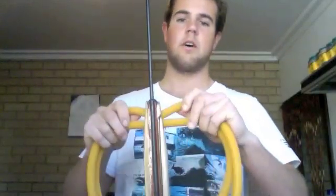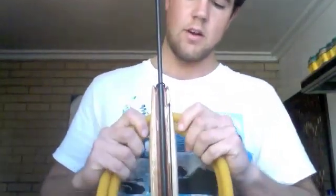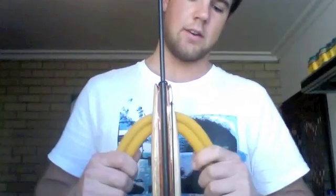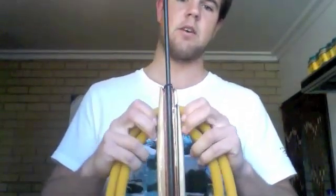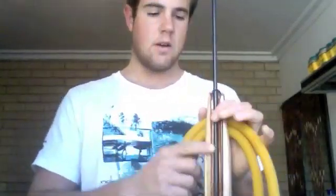The rubbers, I got 2. I had 3, as the pictures shown in a minute will demonstrate. But after test firing it earlier today, I decided that I didn't need that much power for the sort of fishing that I do. So 2 16mm bands. I have cut them about 5 centimeters shorter than recommended, just to get a little bit of extra kick out of it.